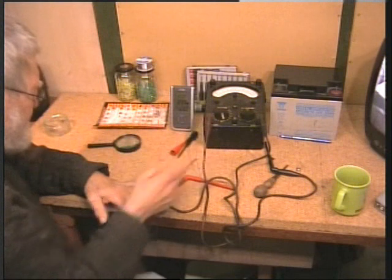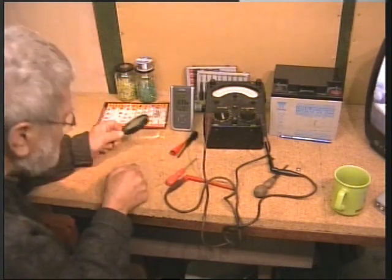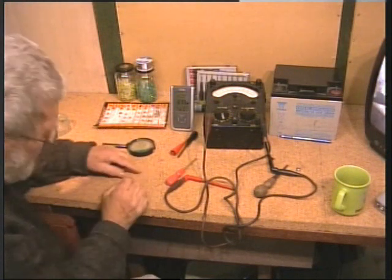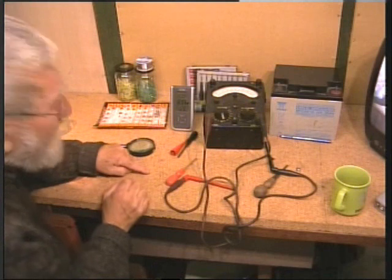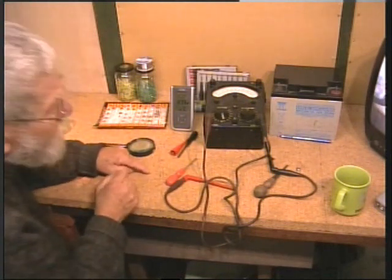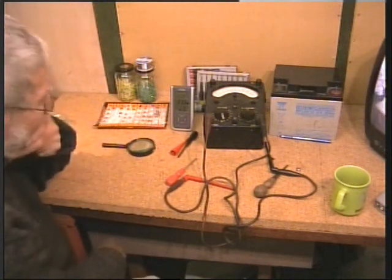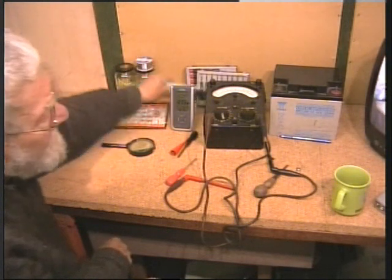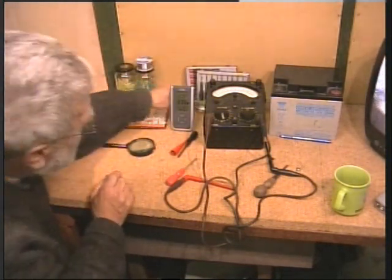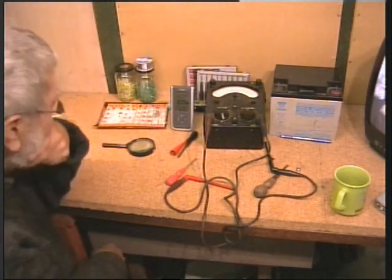Anyway, I'm looking through this circuit very, very carefully, every inch, little bit by little bit. There was a piece of circuit running along, and it came to a point, and then it stopped. Just ahead of it, there was a tiny little hole with a little wire sticking through, and it was a leg of a transistor. So I got my old soldering iron and bridged that little gap with a drop of solder, and it all fired up and worked brilliantly.